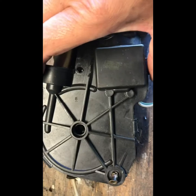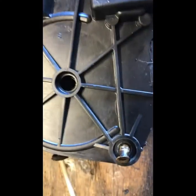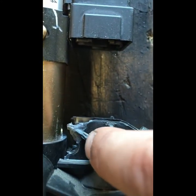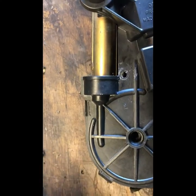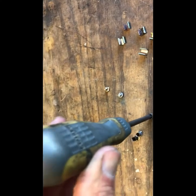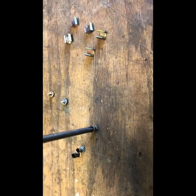But the case is also riveted on. As you can see there's one here, one in the middle, one there, and this one broke as I was taking it out. The best way I found — I'm sure maybe you can find a better way — I just put a screwdriver in it and started tapping with a hammer, and eventually it works its way out.